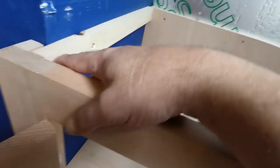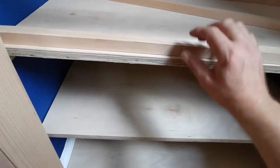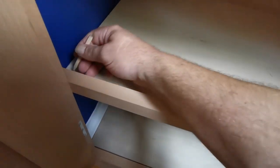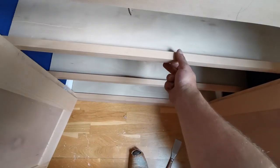With the front frame temporarily screwed back on, I'll add it back at the bottom. These pieces are going to be lips on the front of the ply — what I can do is sit them on there like that, find a sharp pencil, sit them on there, make a mark like that — top, middle. I'll do the same to that one: sit that one there, put a pencil mark there. I'll take all this off, cut those back to that mark, then those lips will sit on the front.